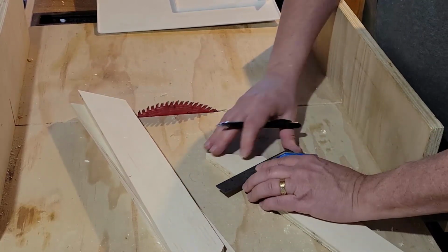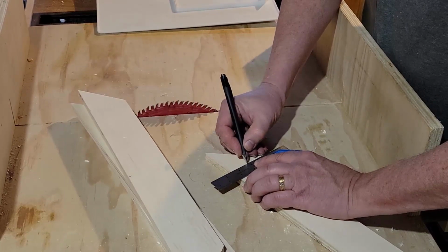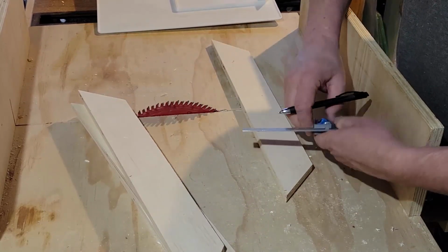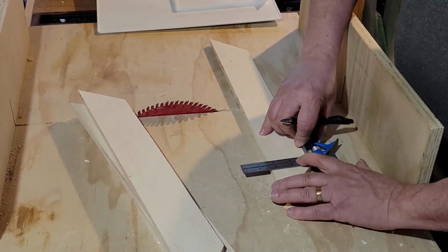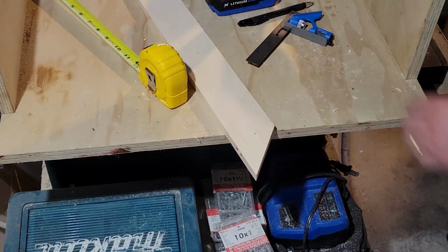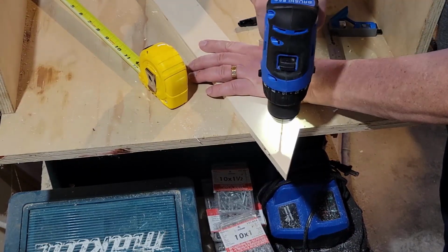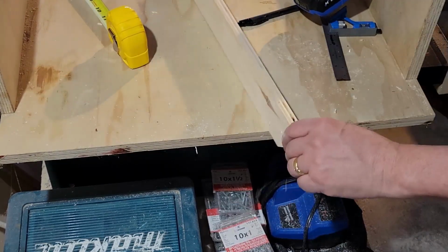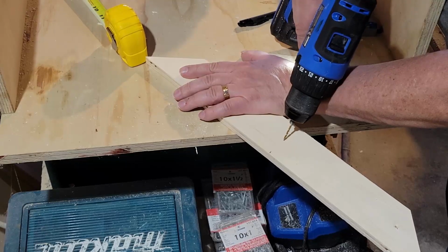Most of this is all going to get hidden, but again, it's just a good idea to know where your screws are going to be, because there's also plumbing up there, and the floor joists, of course, and on top of that, there's also wiring and nails I have to get around. So having these holes pre-drilled and knowing where they're all going to go before I get there is going to save a lot of time and fiddling around on site. I'm also going to bring the drill, of course, just in case I've mismeasured something and something needs minor adjustment. But this will definitely cut down on the amount of time I'm going to spend on site.